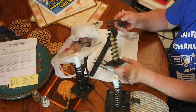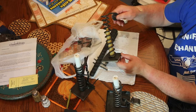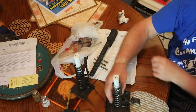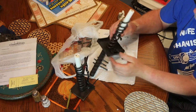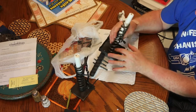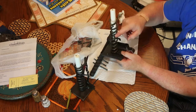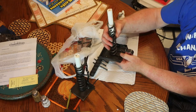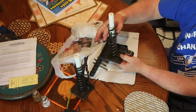Then I think I made this one, and I just put a handle on there and made them kind of long. I think this is the last one I made. I took a square piece of metal, used it as a form, and I bent some heavy sheet metal around it, welded it down, welded a handle on there. Again, I did a treatment like this with kind of a spiral and a leaf, and when you bring this up it'll hit there and stop. It was not intended to be that way, but maybe that's a good feature.